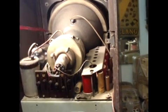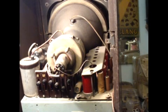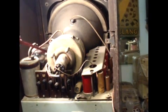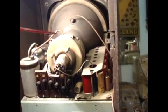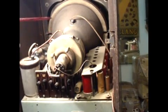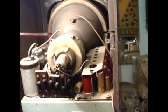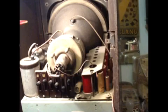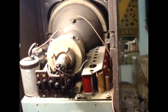The sync separator valve — that's the valve that separates the synchronising pulses to each timebase to lock the picture. That circuit is around a valve around the back there. You've got the focus coil. You pass a current through the coil, which is variable by the focus control, and you can set the actual electron stream to impinge in perfect focus on the actual screen — otherwise you'd get a very blurred picture.